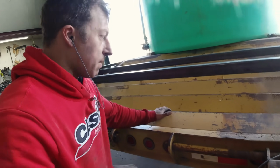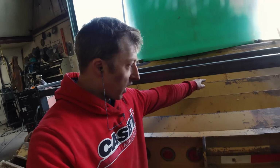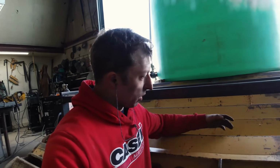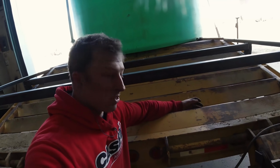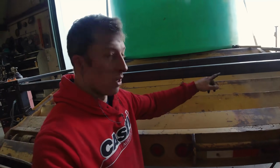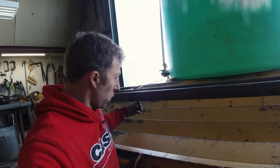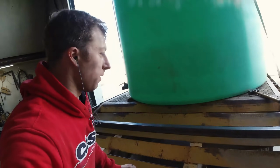They've got the I-beams which run down this trailer, come all the way into this beaver tail here to support the weight of, well, I think I mentioned earlier, an excavator or some kind of crawler of some type to crawl up here. I'm going to build supports that come off of the I-beams here and go up and attach to this 2x2 square tubing, heavy walled square tubing. So there'll be four posts, 1, 2, 3, 4. I might even do more.